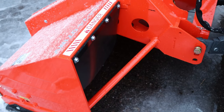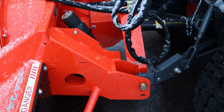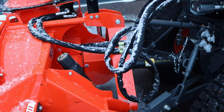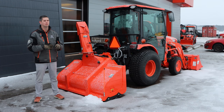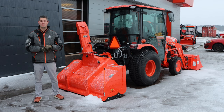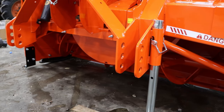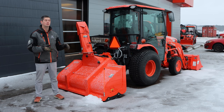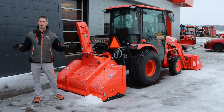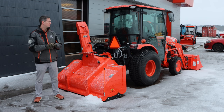It's nice to see Kubota jump in and release this for the Canadian market at 64 inch — perfect sizing for a lot of their small tractors. Whether it be up here in Canada, RAD Technology makes these; down in the States you might see Land Pride. They're going to come out with a full lineup — from 54 inch, 64, 74s and 80s. This one is residential use, though some commercial ones may come as well. Being 64 inches wide, it's going to be for 25 to 55 horsepower tractors — on the Kubota lineup that's your B01s, LXs, and L01s or L02s. Any tractor roughly 60 inches wide or less will accommodate this as long as it can take the weight.